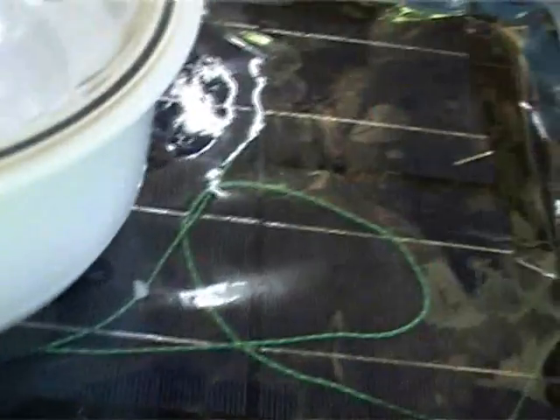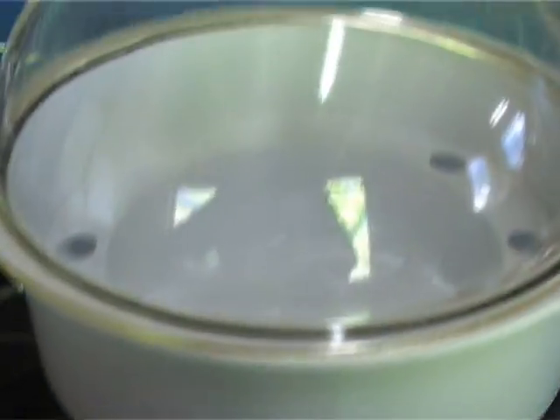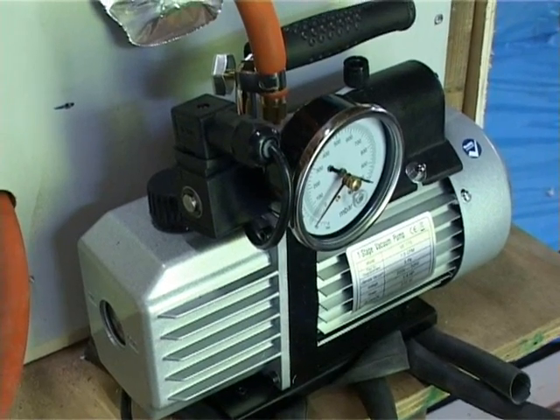This is the stuff — it becomes very clear and it stays like that. First you mix it, then you have to put it into this vacuum chamber to degas it. After you've degassed it, which takes about 10 minutes, it stays the same for a week or something.